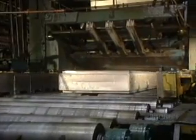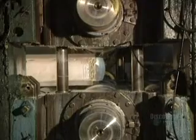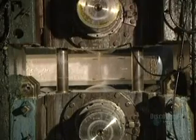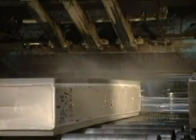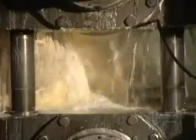The many steps in the thinning of the ingot begin. The aluminum block is crushed by the hot mill rollers, with temperatures between 455 and 540 degrees centigrade. Pressure on the ingot is continually verified by a technician — if too great, it's lowered and adjusted. The heat is so high that the ingot risks sticking to the rollers, so everything is cooled with a liquid that's 95% water and 5% oil.